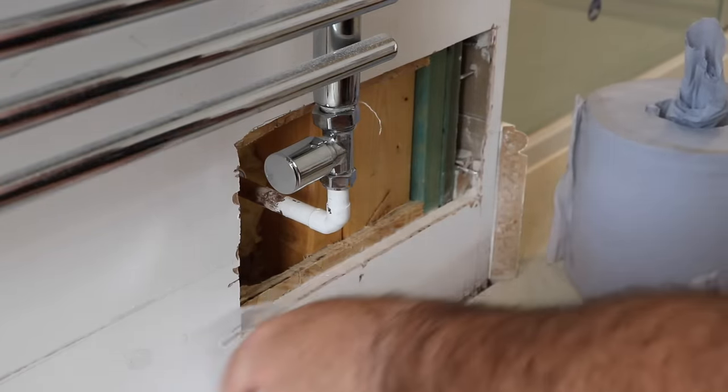I'm going to leave all the joints open for a couple of days since I'm in no rush to put everything back. Ironically, because I've got the OSB right behind the plasterboard, it's going to make a really good lip to fix some new plasterboard to, so I can fill these holes and no one will ever know I moved this rail. If you're going to drain down your heating system — or even partially drain it down — expect some air still to be in it when you recharge it. Use it for a couple of days then go around all your radiators and re-bleed them; one or two may have quite a lot of air as it works its way around the system. I hope you've enjoyed this video and it's given you some clues on how to move radiators.